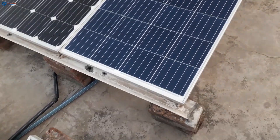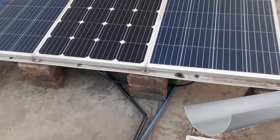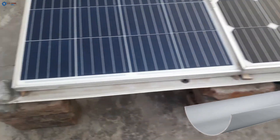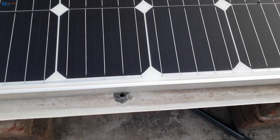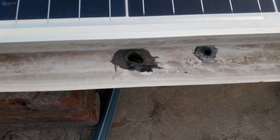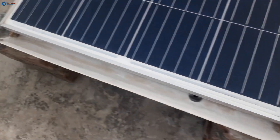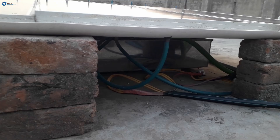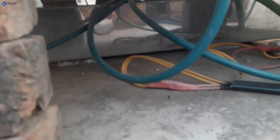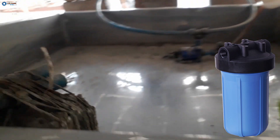This is another interesting area — the bottom side of the solar panels, the place where the sliding water is collected. I took a PVC pipe and cut it in half, making two pieces. I placed one piece under the solar panels to collect the water effectively. Both ends of the PVC pipe are blocked so water does not escape from the sides. There are also holes in the PVC pipe where the water escapes in a controlled way and is transported back to the water bucket to be recycled. There should also be a filter at this point so the dust in the water is cleaned before it re-enters the bucket.